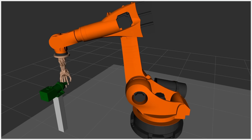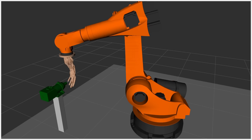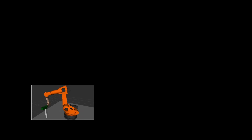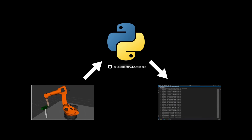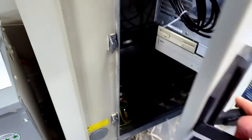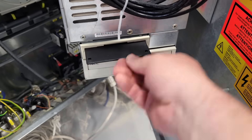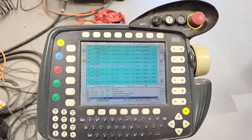Once we know for sure that the robot can actually reach all of the points without colliding and without hitting joint limits or singularity, we can take those positions and process them through a really basic Python script that turns it directly into KUKA's language called KRL. That gives us a file that we can load on the robot, and the robot's controller will run through it line by line to go to all of the points that we created from our CAM system.